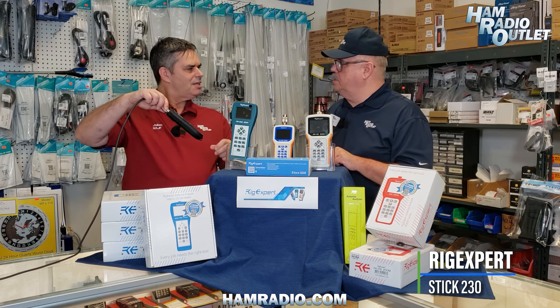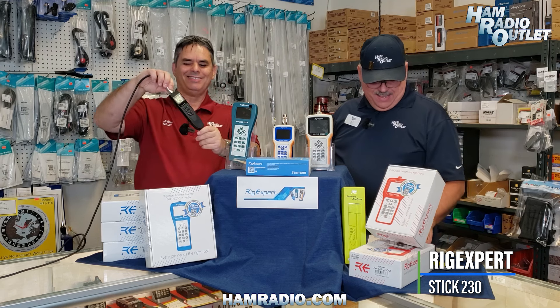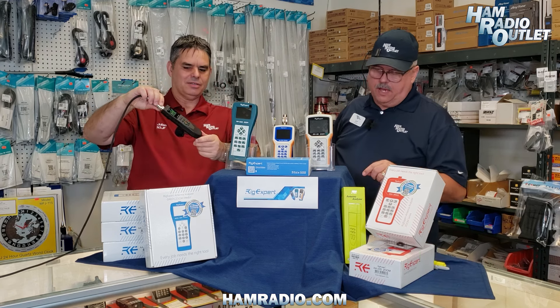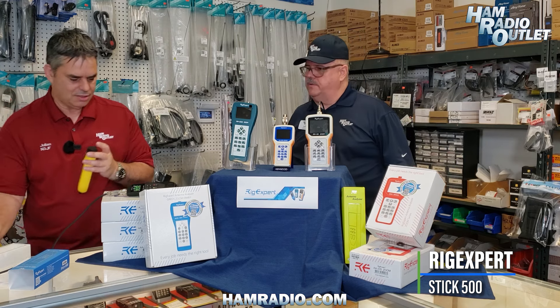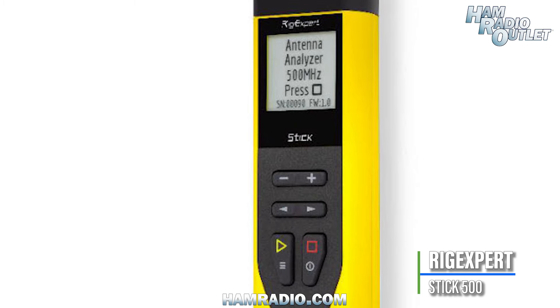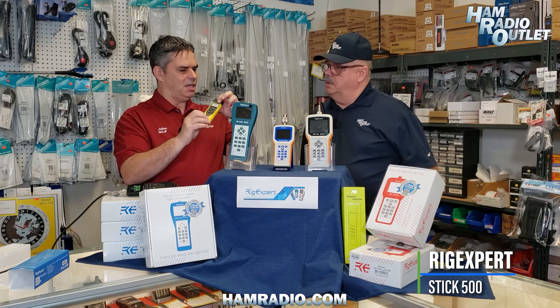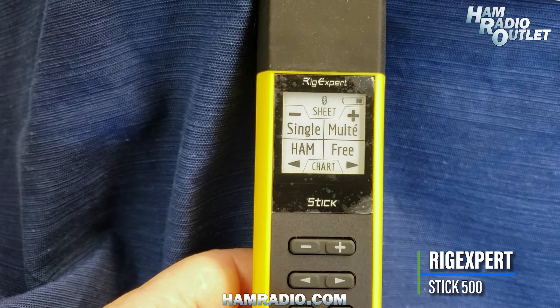Do you carry one of those? I do — just when I'm walking around. I want everybody to know I have a Stick 500. The Stick 500 comes in yellow and goes up to 500 megahertz, covering HF, VHF, 2 meters, and 70 centimeters. These have about 16 hours of runtime. The Stick has an e-paper or e-ink display, so it's always on — it only changes when you're actually doing something with it, giving very long battery life. The Zoom models have a TFT — thin film transistor — display, which is really bright but visible in any lighting conditions.